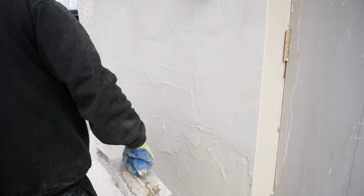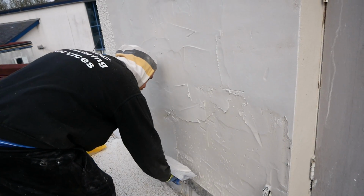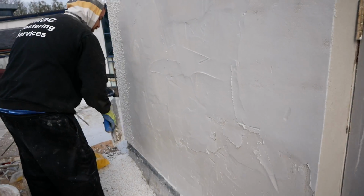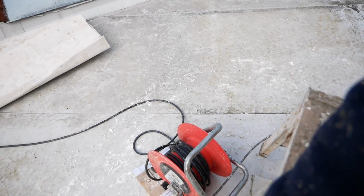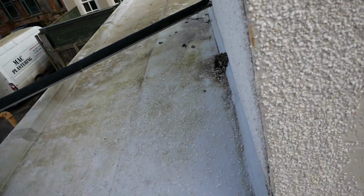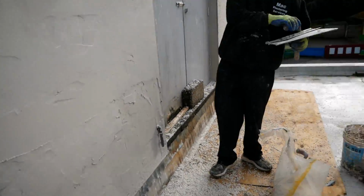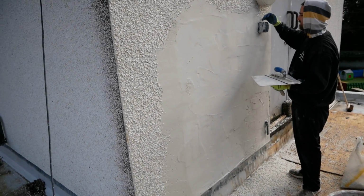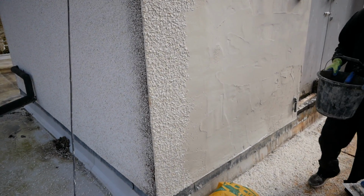But yeah, the idea here is just getting it all laid down, neat as can, as you know, don't want no joints. I probably will hit them joints a wee quick one with the wee stones. Just keep shrinking your joint, so that it doesn't show a joint basically. Once you hit them stones on, if it dries too much in one place, the stones will bounce off and it won't be very pretty looking. So you're going to want to get it quickly coated and stoned, as quick as you can, but trying to be as neat as possible.